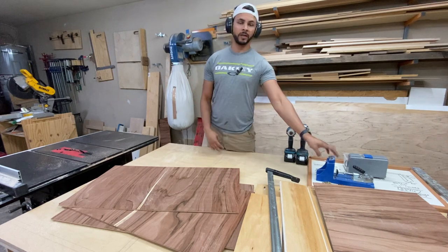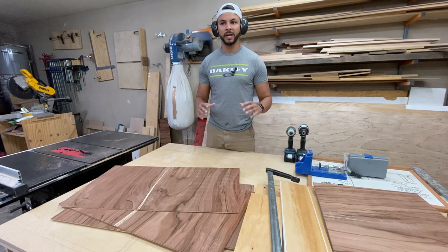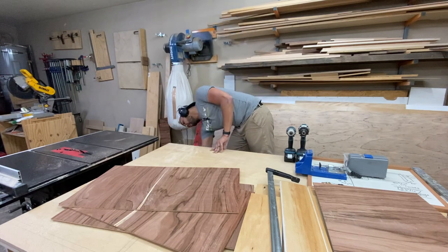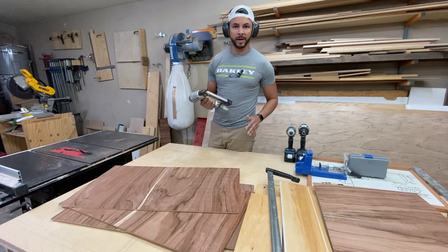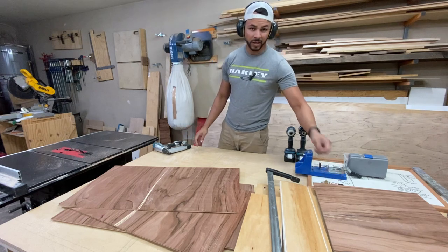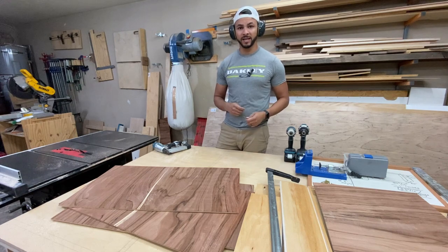Which is where we're going to talk about our three different methods. There's the pocket hole jig — that'll drill the front and back into the sides, hide your plywood edges, and just give you a clean look. Very, very secure, very strong. The second option is going to be just glue and brad nails. You don't need an air gun per se — you could use one of the battery-powered ones. And the third option is going to be just plain old screws. You need to pre-drill and countersink these screws, otherwise you're going to get splitting because it's plywood and there's not a lot of room to dig in.